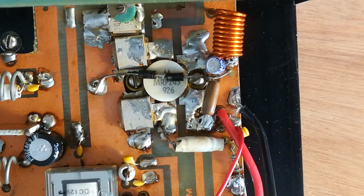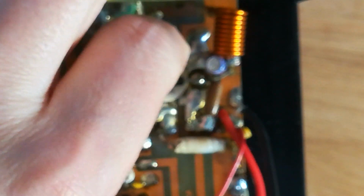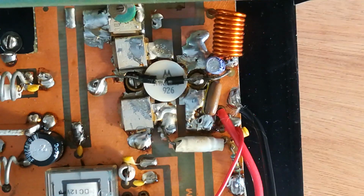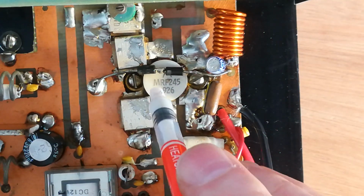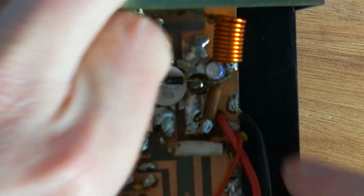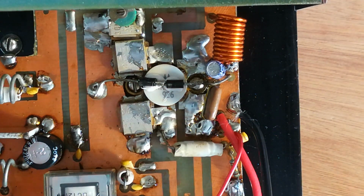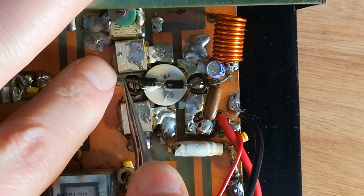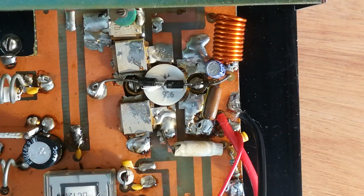So we've got some thermal compound, and we'll see if we can pop some underneath the diodes, and a bit more of a clean. Let it evaporate, and we should be okay to go. It doesn't need much. That would be enough. Less is more, as they say. So there we go. Let's just push it down, make sure they're tight against the transistor. Pretty good.